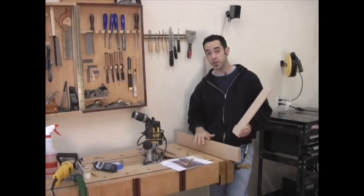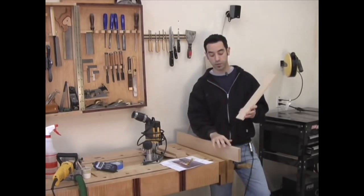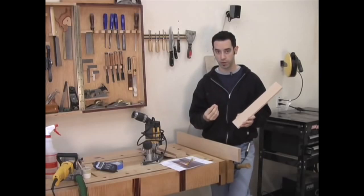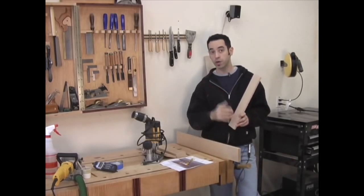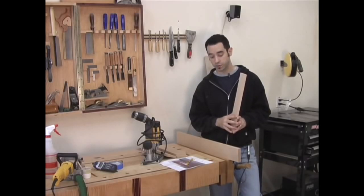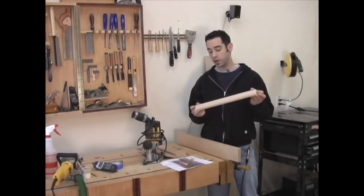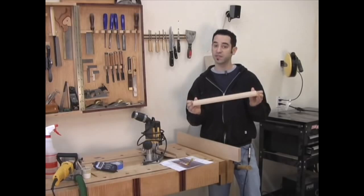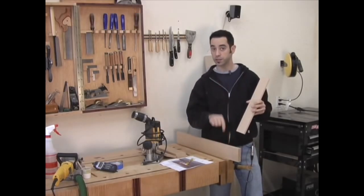When installing slats into an apron, I find it easier to insert the entire slat into a mortise that's cut perfectly sized for that piece. But it can be tricky, so you may want to consider a smaller mortise and a small tenon on the slat, giving you the advantage of a shoulder for a cleaner appearance. If your mortise accuracy is off — whether from a router slip or a misaligned hollow chisel mortiser — a tenon and shoulder will help. Quick correction: if you want integral tenons on your side slats, cut them to 18¼ inches long instead of 16¼ — that gives you a 1-inch tenon on each side.